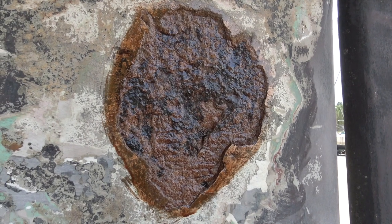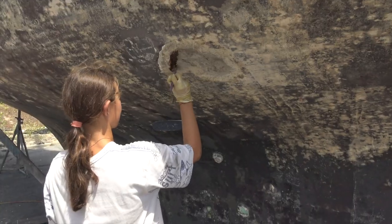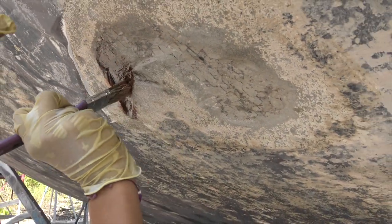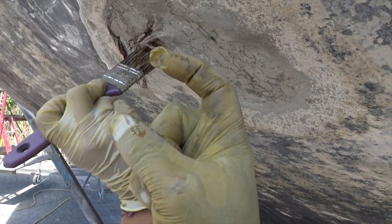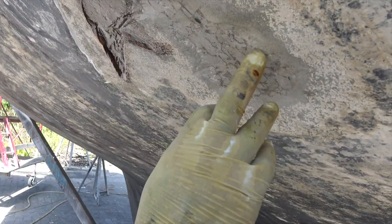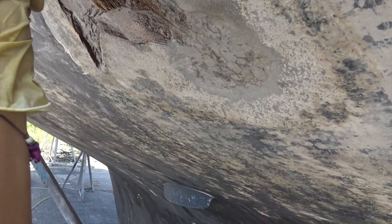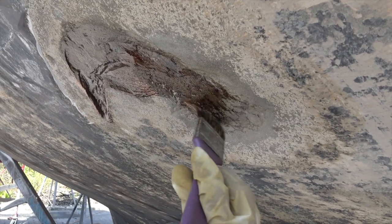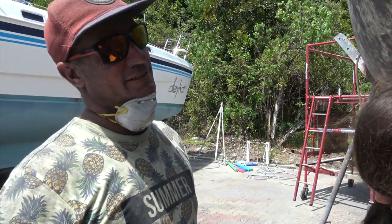For clear instructions for the people at home, probably read the tin. Lee recommends one to two hours, ladies and gentlemen. Hull number two — Bella's really working it in this time. As you can see, it's just the top layer that's been affected. This is actually probably about 50mm thick. You can see there's chicken wire here, and behind that will be the actual mesh of the boat. As long as you can see the chicken wire, the rust hasn't even gone through yet. So catch it at this stage — easy fix. Leave it a few more years and it may get into the hull.